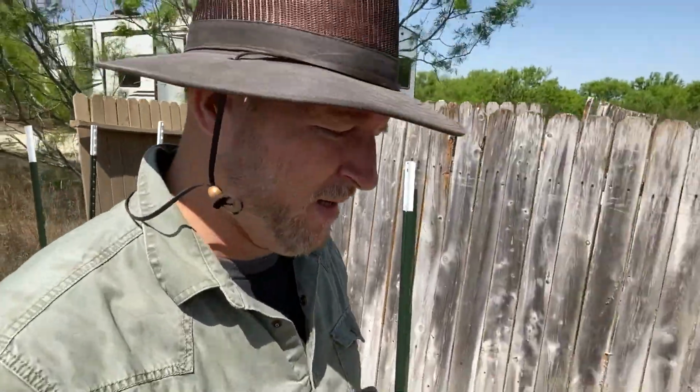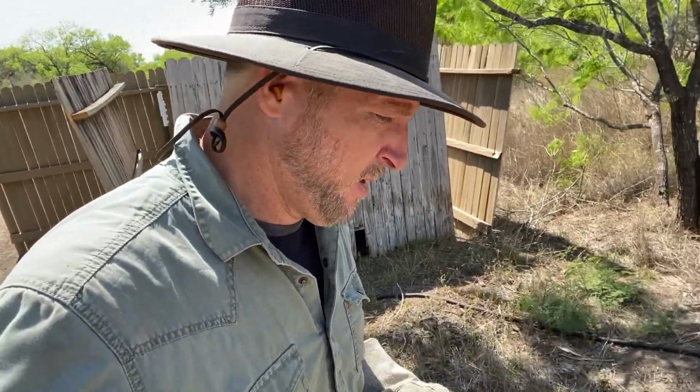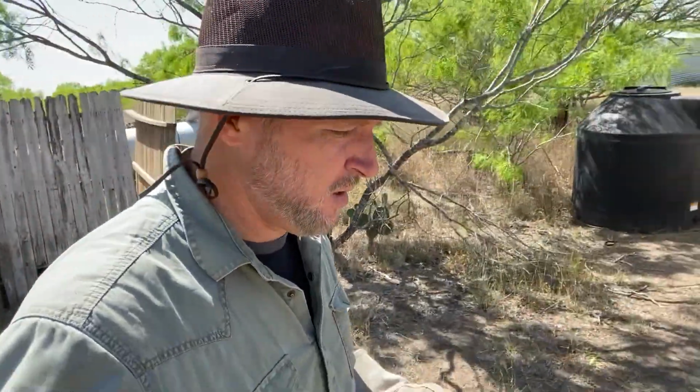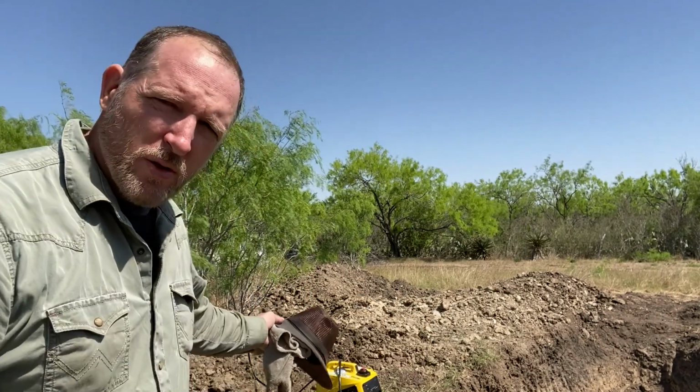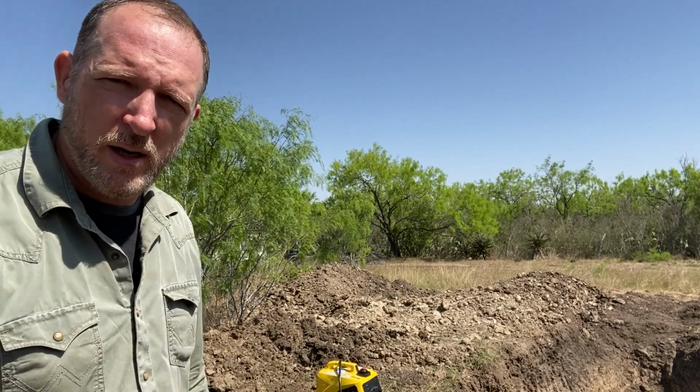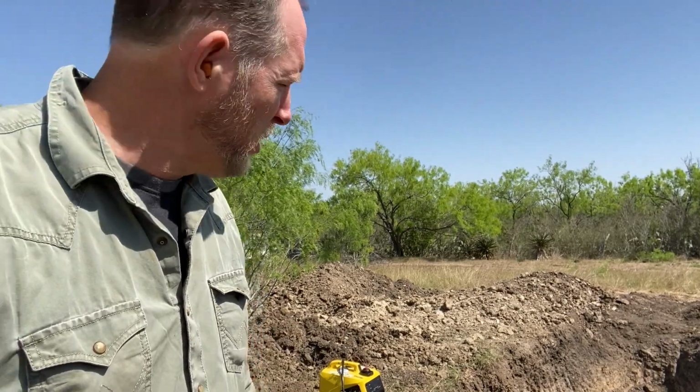Well, that didn't work. So very well could be that it's some component inside, like a capacitor, that is not working anymore. Again, the 220 works, but the 110 doesn't. I can't get the 110 volt to work on my generator, so I'm going to go to my smaller generator and see if that works. It's also a dual fuel generator, and I'm going to use propane on it also.